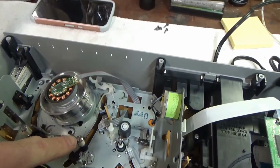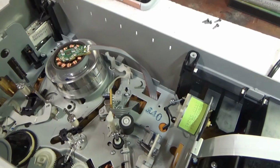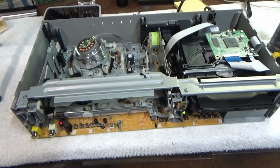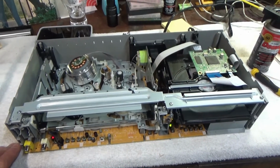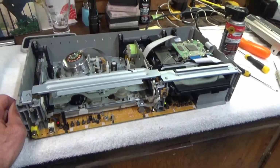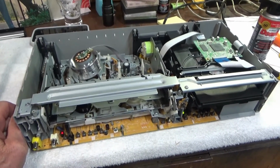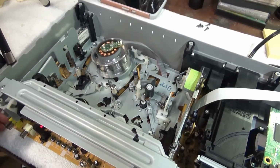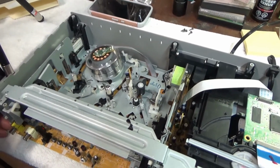So I'll go ahead and clean the tape path and the pinch roller and the capstan and everything. Clean the heads. But it looks like this VCR is working again. So there you go, even in the 2006 unit, what is that, 2021, so it's 16, 17 years old. I guess that's pretty old by now. But this is definitely one of the last ones VCR was built, I would think. And even at this point, the mode control switches are getting so dirty that they no longer work and need to be cleaned. Of course, good luck finding somebody, other than just a hobbyist, who knows how to work on these things for you.